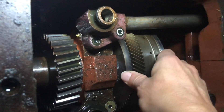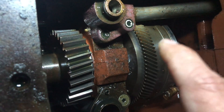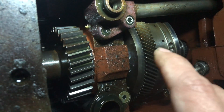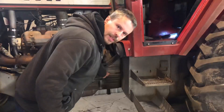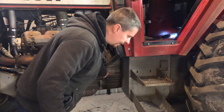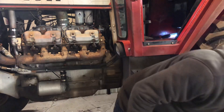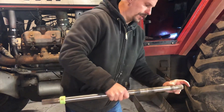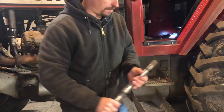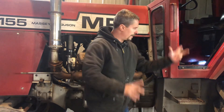Something's not right there. That should only spin about just a couple of thousandths — whatever slop you have between the splines on your shaft. That tells me a spline on the end of the flywheel has gone bad. This may be bad, this may be bad, this whole thing may be broken. Now, in the case of my 1100 when I did this exactly two years ago — because it had exactly the same problem — the little coupler that goes into the PTO shaft was stripped completely out. Hence, not turning the charge pump, not feeding any hydraulic oil to the big pump in the front. And thus forth, no hydraulics. We've got all the same symptoms here.